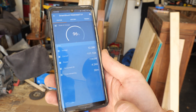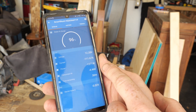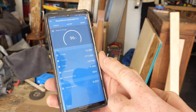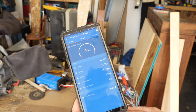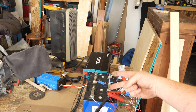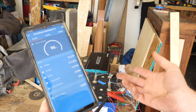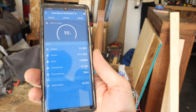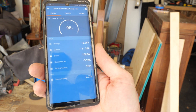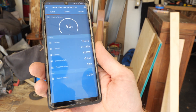The BMS hasn't been zeroed for state of charge, but we're still pulling just under 1400 watts at 110 amps. I've done this once before and everything stays nice and cool. When the terminals get hot I'm not worried, but it is one reason why I have two BMS units instead of trying to run an eight-cell pack on one BMS — just for safety. There is one BMS for each four cells, so I have no qualms running this thing at full load.